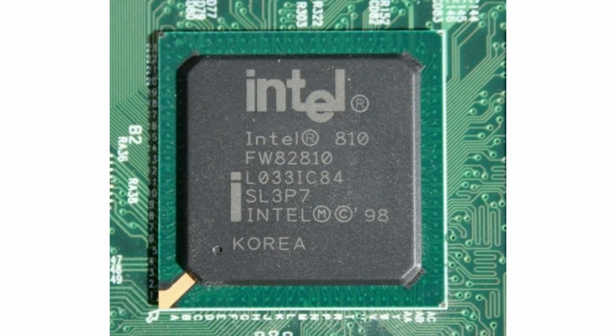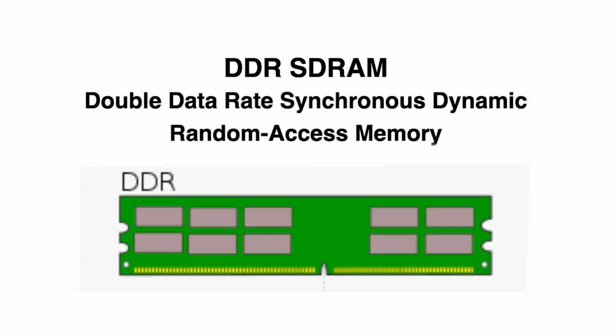To deliver realistic, intense 3D graphics, fast rendering, high detail, and smooth motion, the PXI-8186 controller features an integrated Intel Extreme Graphics core. Thus, the user will not need an additional video card. This controller utilizes double data rate SDRAM, or DDR SDRAM. The SDRAM doubles memory bandwidth, since it transfers data twice per cycle.